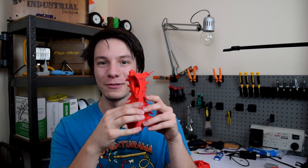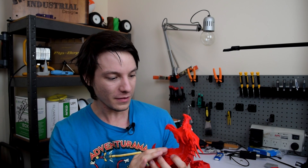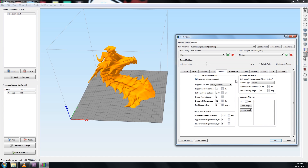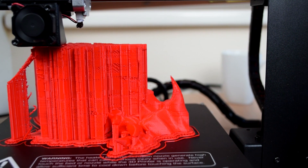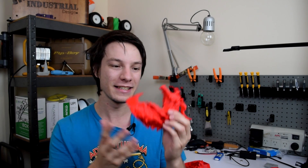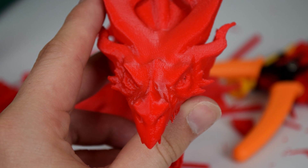Next, I went a little bit more ambitious and I printed Alduin. I'll put a link in the description where to get this model. I sliced him using Simplify 3D, but I made a mistake — I sliced him on settings for my old Wanhao at 190 degrees temperature. You can see it's got a few layers where the extrusion hasn't been quite right. I dropped it off the table and it split very easily, so the layer adhesion was very low. I think that's because the temperature was too low.